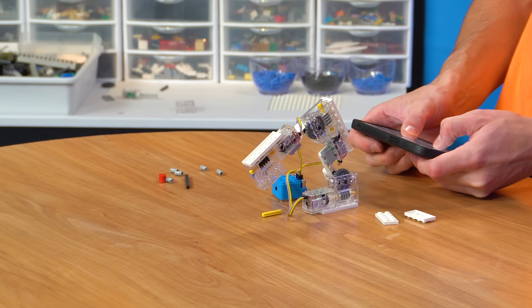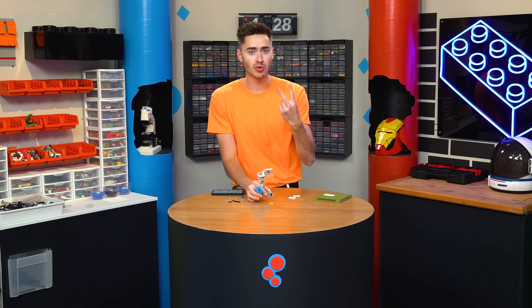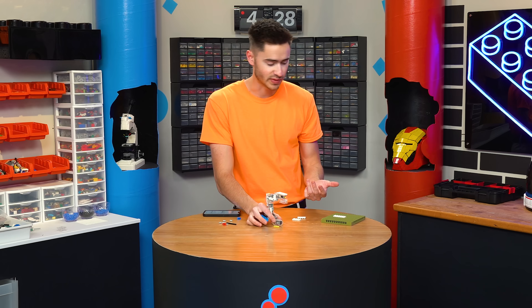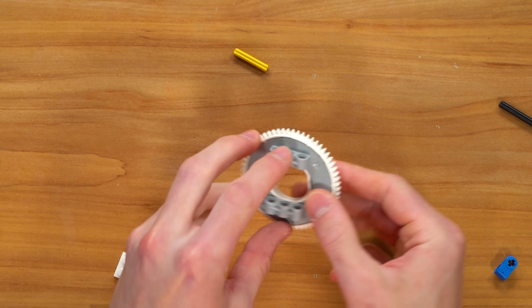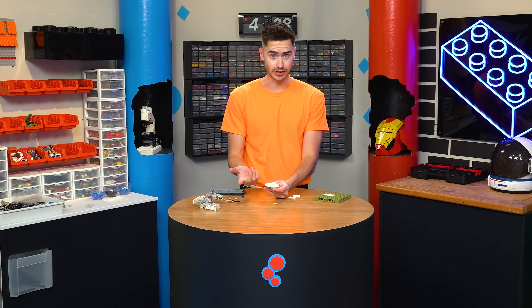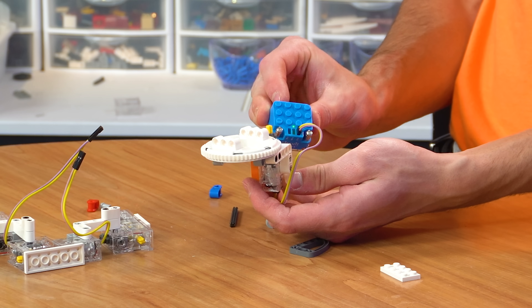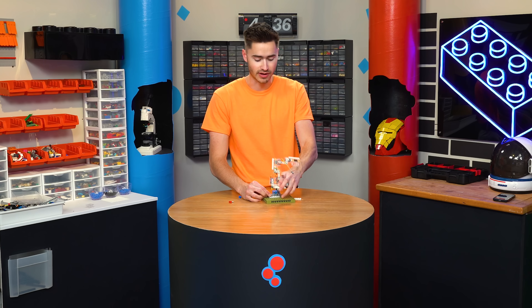Check it out — we can move just like that. Before we can add this to the rover, we need to add two more things: the ability to rotate, adding another axis of movement, and an opening and closing claw. To make it rotate, I'm going to use one of these pieces because it has a little gear on it, which means we can drive it. Then we just got to attach this and build the claw that's going to actually pick stuff up.